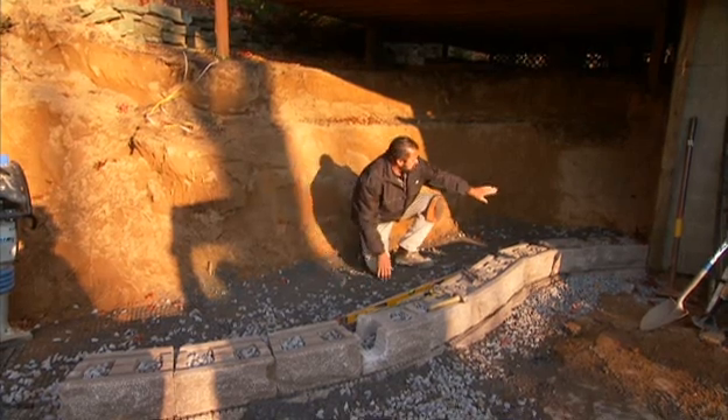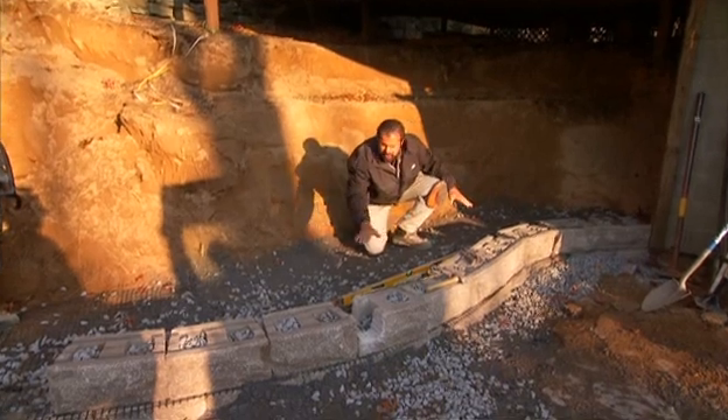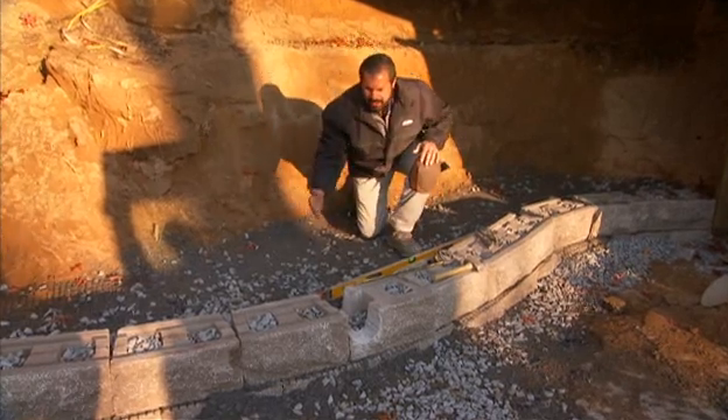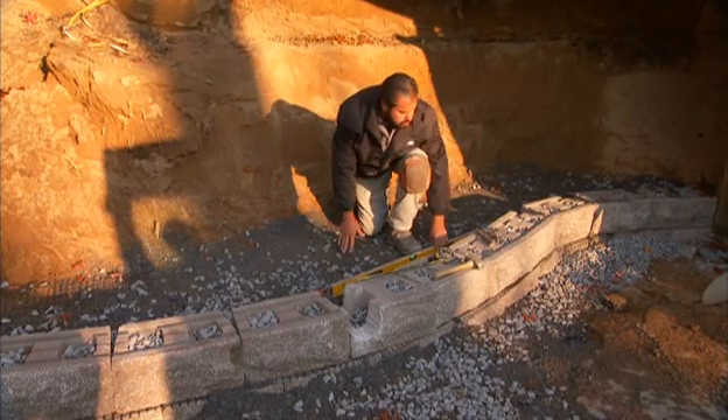I've built my base up here about two inches high to zero, so I have good positive gravity flow of water. I'm going to put in a piece of geotextile fabric, a couple of pieces, so I can daylight my pipe out there after I install a four-inch layer of clean stone.